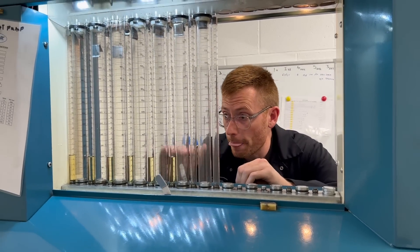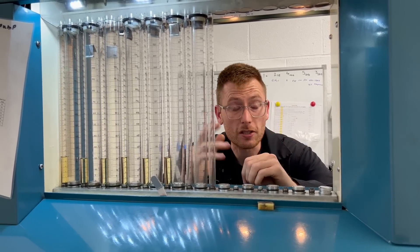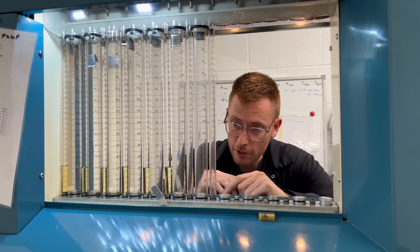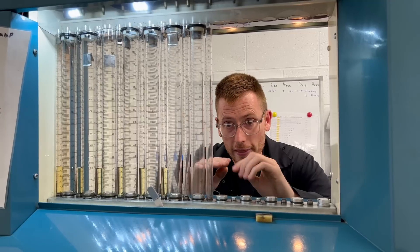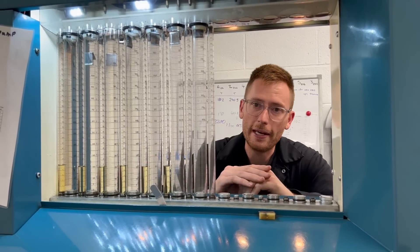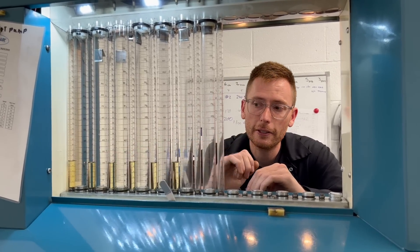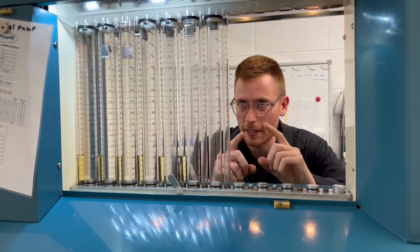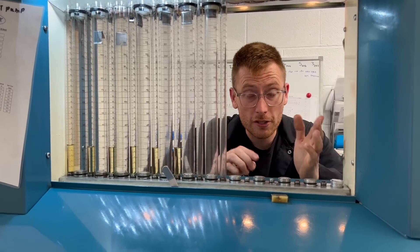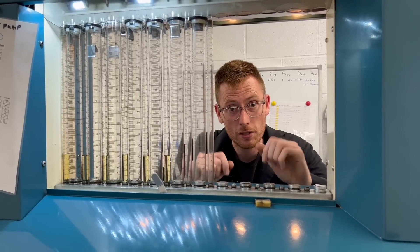You're going to see these tubes all settle a little. What I was trying to hit is 50 CC as an average. Now with these mechanical pumps, especially with larger elements, we have to get the best average we can get. I try to get the idle quantities — the lower quantities at tick over — to be absolutely bang on, and then I let that dictate what the rest of the RPM range can give us in terms of the evenness between each cylinder. It's dangerous doing it the other way because you can have bad idle. The best practice is to keep the cylinders within about 5% of each other — that seems to be about the golden rule.